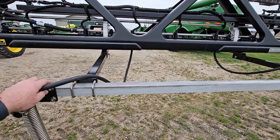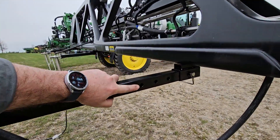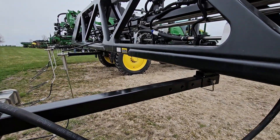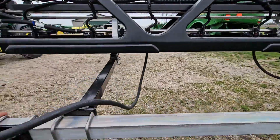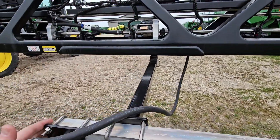This is right over the front steer tire, so on this one for sure, start out in the furthest out position on this 26-inch extension. Same thing as two and three — just a little bit different positioning, obviously, but same concept. Tighten these up first, then get your receivers tightened up.